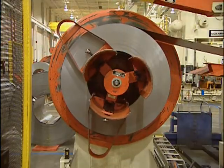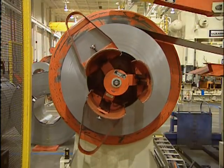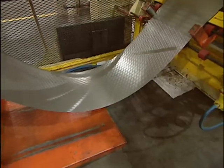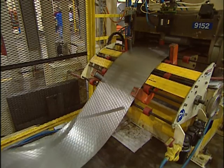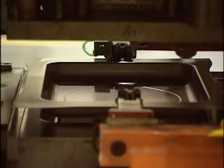The rolls are placed on giant feeder wheels, and the oven-making process begins. The steel is first fed into a stamping machine. Different machines stamp out different parts of the range. This machine is making oven trays. The steel is cut, then sent to the first press, which creates the cavity.